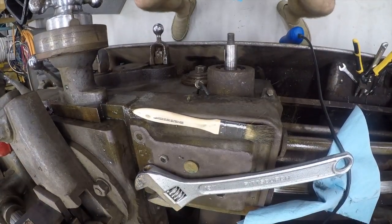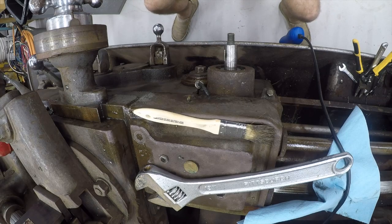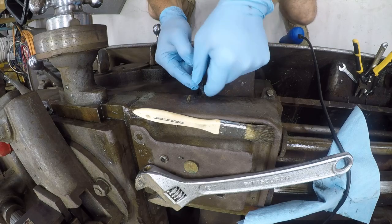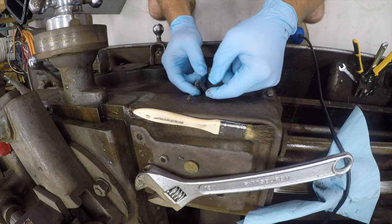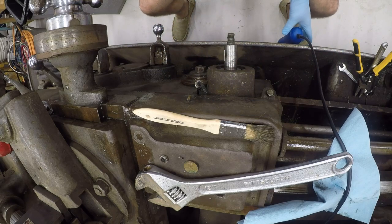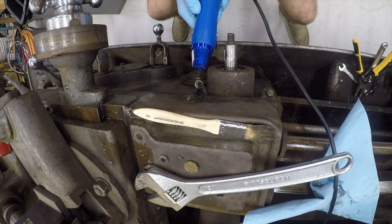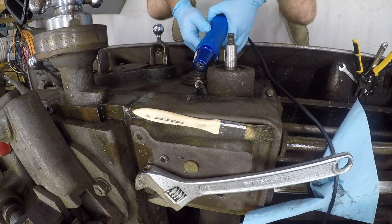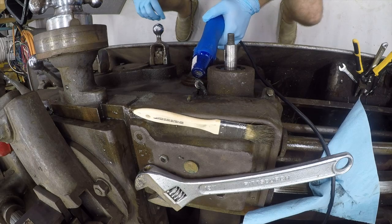So I'm going through the machine and cleaning it up a bit. I need to get some kerosene, which I don't have — that's the solvent used on machine tools. This lubrication line is disconnected, and it looks like it's just a little piece of rubber hose being used with nuts as a clamp. When you have rubber hose that's sticky and old, a heat gun will make it play nice — so that's what we're going to use.